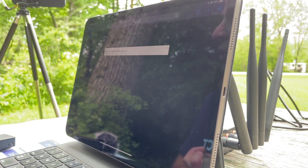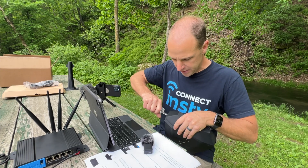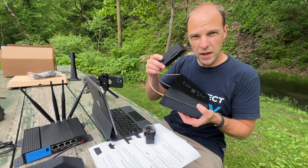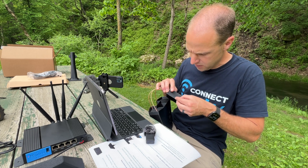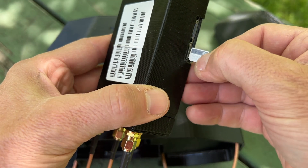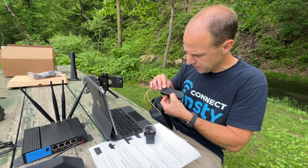The modem module is shipped inside the wings — inside the Cloud Wings as well as our 4G wings. For the Cloud Wings, you need a flathead screwdriver to open the lid. Once the lid is open, the modem module is right inside. We're going to slide the modem module out of the wings and take our SIM card and place it in SIM slot 1, which is the slot closest to the antenna connectors. The SIM card goes in facing the front of the modem — the front has the sticker on it. Put the curved portion in first with the contacts down, and push it in until you hear it click.